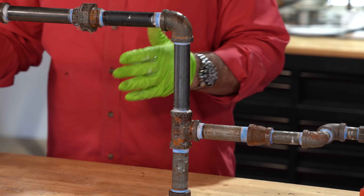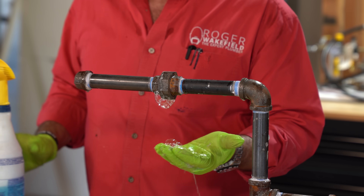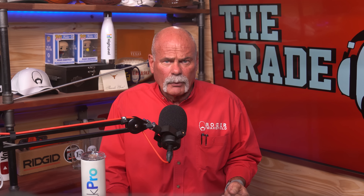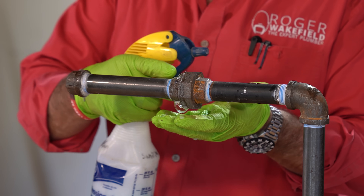Another mistake is not testing the system properly after installing or after making a repair. A leak test with soapy water is a simple but effective way. If bubbles form, you've got a leak. One of the coolest leaks I ever found — I had tested a whole house, and as I got outside, I realized the smell was coming through the wall. I went outside, soaped everything down, and noticed that as the soapy water ran down, the bubbles were coming from underground. It was a very simple repair — we had to dig it up and replace the gas riser. The bubbles led us right to the leak, and it was very easy to show the homeowner.